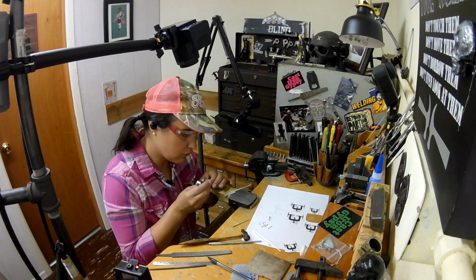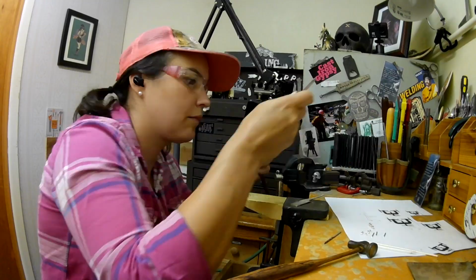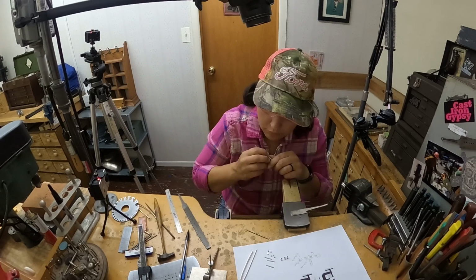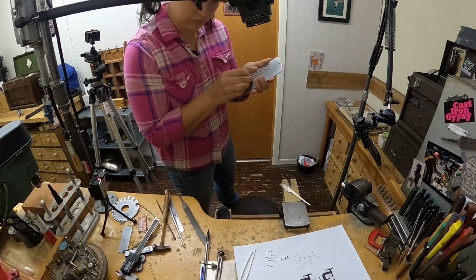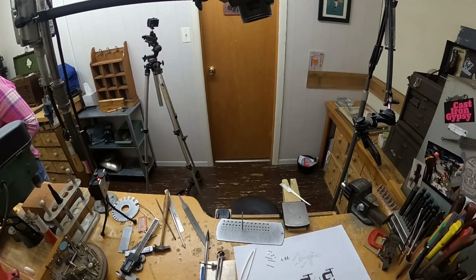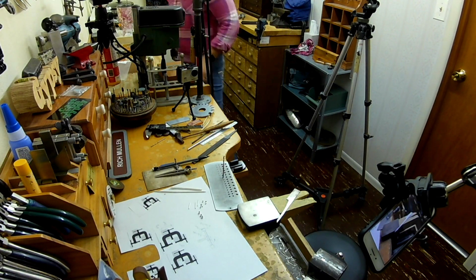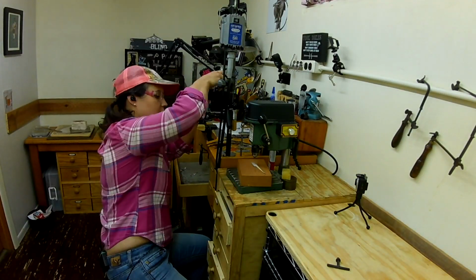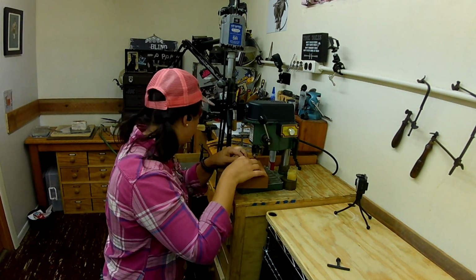And so then this is taking some 20 gauge, it's probably 18 gauge sterling silver sheet and fabricating the little jaws that are going to be on the inside that's actually going to touch whatever the clamp is clamping. I center punched 3 individual little punctures, and then I used my dividers set at the radius that I wanted them to be. And then I traced the circles, and now you can see I'm drilling through the centers where I center punched.